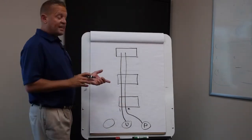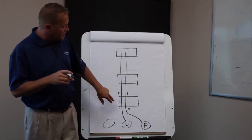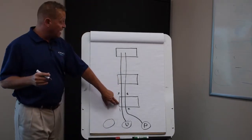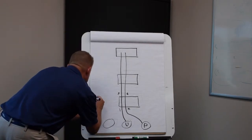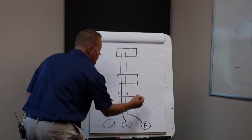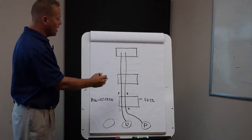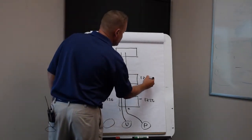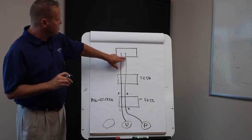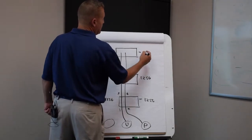In a very standard setup with three dispensers in a row — say this is the unleaded tank and this is the premium tank — we run the unleaded line up one side and terminate, then bring the premium in next to it. I look for my unleaded line and see it's entering the lower corner of the sump, so I know that's position one. Then position two is next to it. On my diagram, position five and position six are on the upper row. So for a DSL with DPC couplings, standard DEB entry boots, and 1.5" pipe going into an Encore, this part number is DSL-15-1836, and since the pipe comes in at one, out at five, in at two, and out at six — the final digits are 1256.